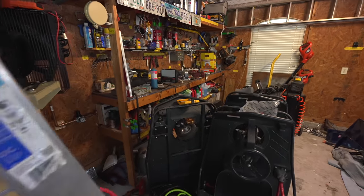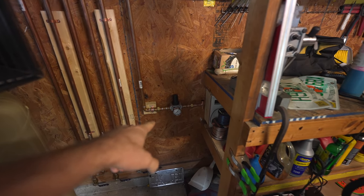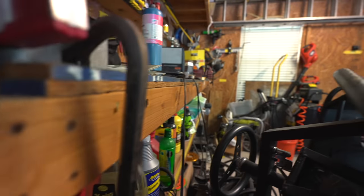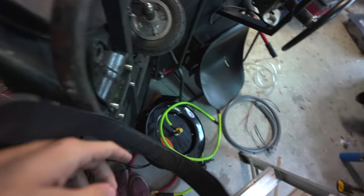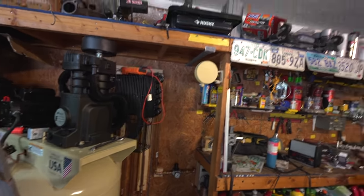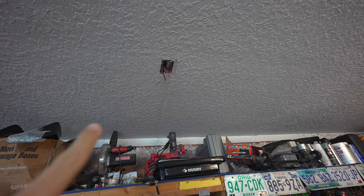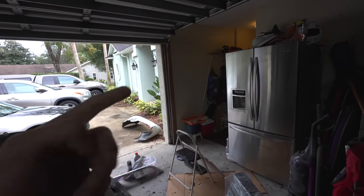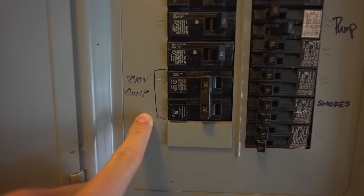We are back in the garage making more progress on the air compressor setup. This is not a Trump hat — it's a 'Make Drifting Great Again' hat, something we can all get behind. I have the copper manifold mounted against the wall and I've already started hooking up the pressure regulator. You can see how I'm going to tee it off and have both legs come up against each of the two-by-fours that support the workbench. For the electrical, we ran 8-gauge 3-conductor wire through the attic — though in reality we only needed 8-gauge 2-conductor since it has two power wires and a ground. We put in a 30-amp breaker for the compressor.